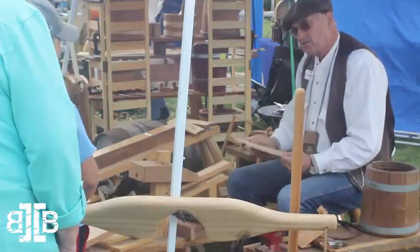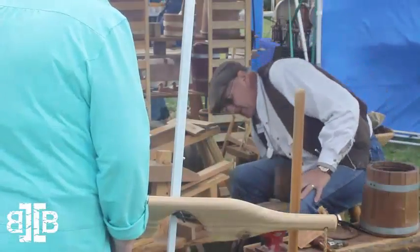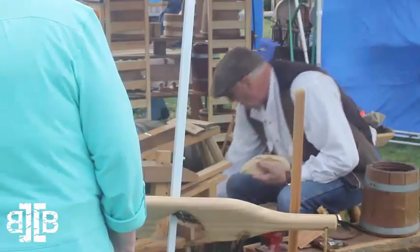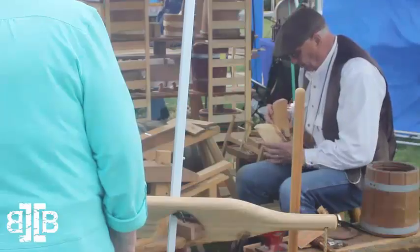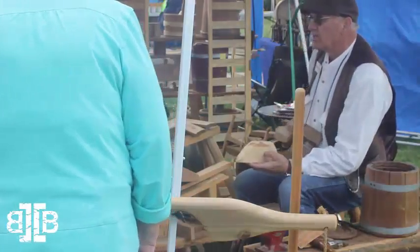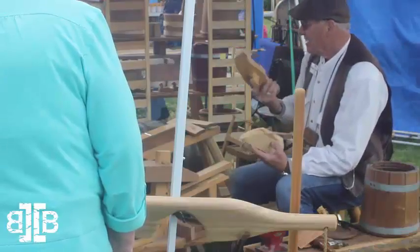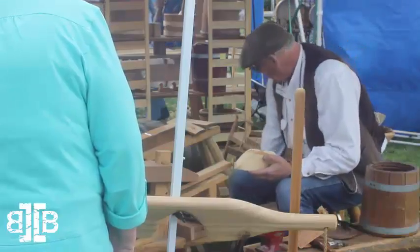Okay, then when I get this cut out, the edge is too thick to fit in that groove. And in fact, sometimes I'm using a board of full thickness, so I need to thin it down. So I will take the blade and put it right to the wood and mark it with a pencil, which I've already done. You've heard it said, measure twice and cut once. And they don't measure at all, unless you really have to. I didn't have a chance to misread the reading here or there, and I know it's right.